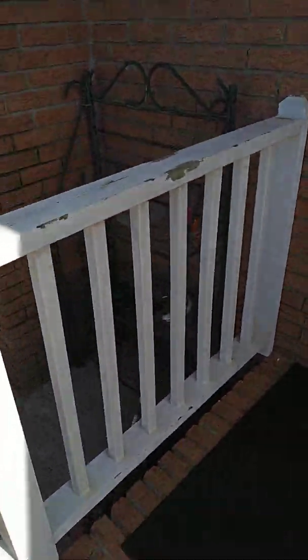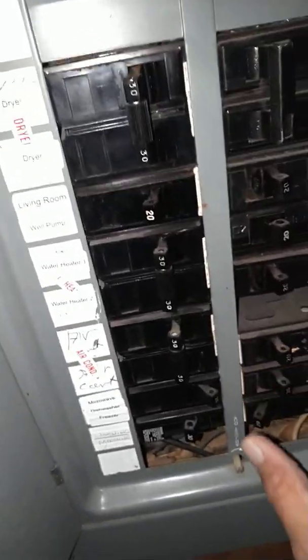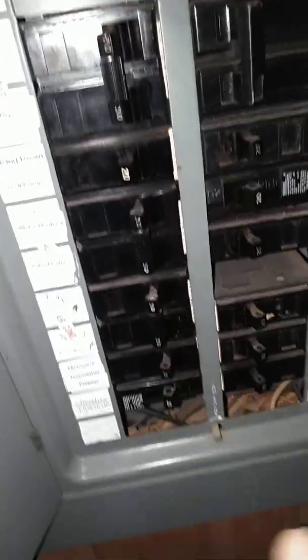I'm going to go back inside just like I would if the power did come back on. We'll walk back down the hallway. If the power did come back on, the green light that you saw blinking would show up and tell me. So what I would do in that particular instance is come in here and go ahead and just cut everything back off, so that I can disconnect the power from the generator. Now all my breakers are back off — everything is cut back off, fans are slowing down, everything is coming to a stop.